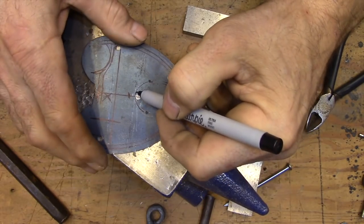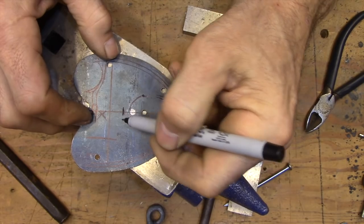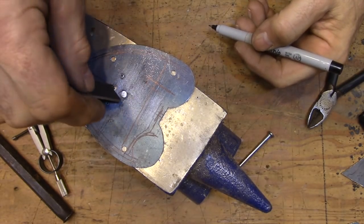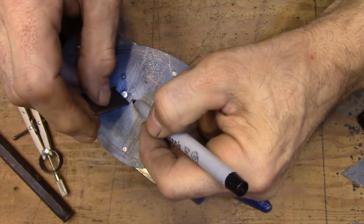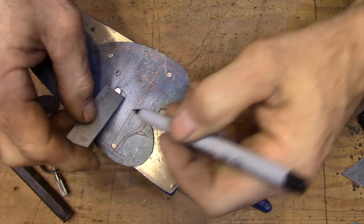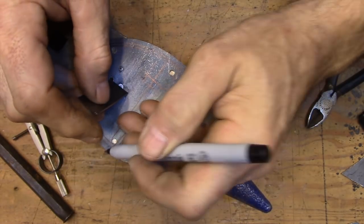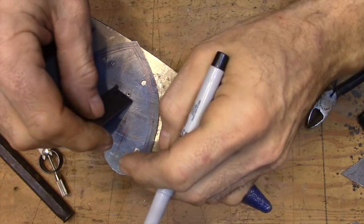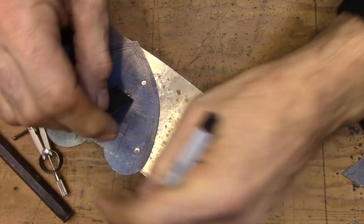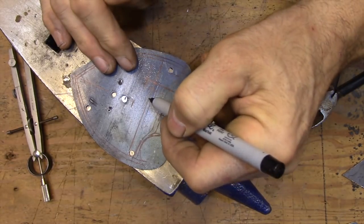None of these lines are carved in stone - this is just a test mock-up to see whether I'm in the ballpark. I'm not using a set of drawings here. This is how a smith would have mocked it up on his anvil - he would have taken one piece, fit the next piece to it, and just kind of worked through the process. So now that I have all the head scratching worked out, I'm ready to actually commit the design to some metal. I'm using a piece of sheet metal with a notch cut on the end representing the size of the key I want to use, and I'll be using that to measure everything else from now on. The advantage over using compasses is that I can have several reference marks on this one plate, and because I filed the pivot point to fit the hole exactly, I'm not getting any error from placing a compass pivot through the center hole.